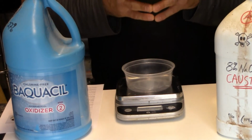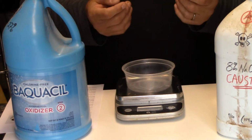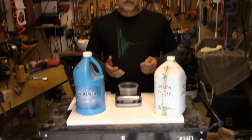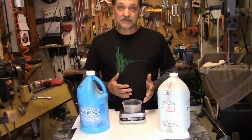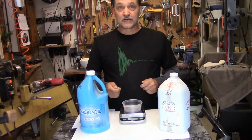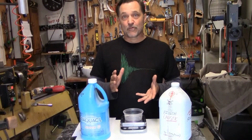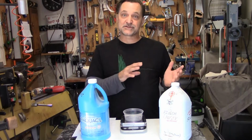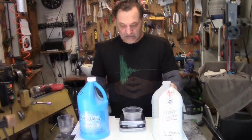And again, probably not doing it on a piece of wood. I have pieces of plastic that I use, and once you've coated it, you just let it dry. If it is not as bleached as you want it to be, you mix another little bit of each of those, and then apply another coat. I usually find 3 to 4 coats gets it just about as far bleached as it can. I think after 4 coats, there are diminishing returns.